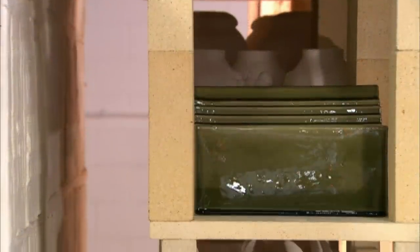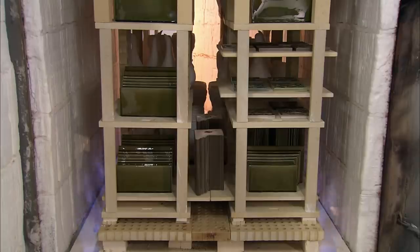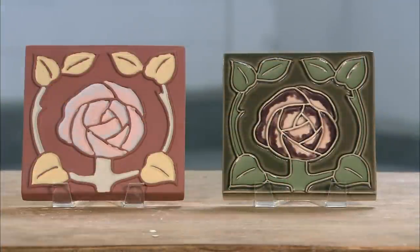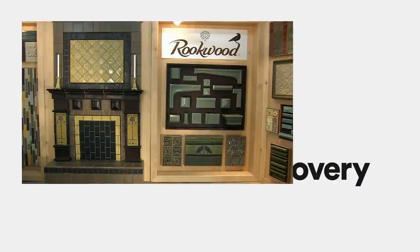The glazed mantle pieces and tiles now go into a gas-fired kiln for 12 to 14 hours. The high temperature — 1200 degrees Celsius — triggers chemical reactions which harden and strengthen the pieces. The clay's mineral composition transforms into a completely new configuration of crystals and glass. As for the glaze, its precise formulation of metallic elements produces a specific color, and the silica melts into a glass surface. The ceramics are now smooth and shiny, ready to transform an otherwise ordinary fireplace into a work of art.